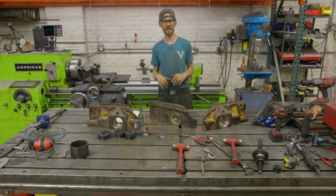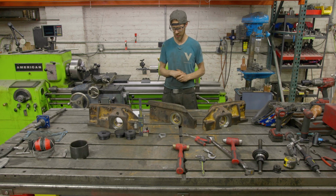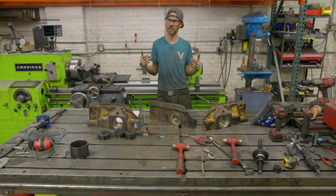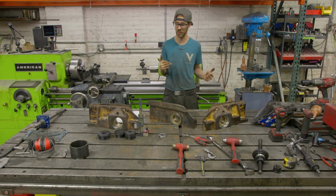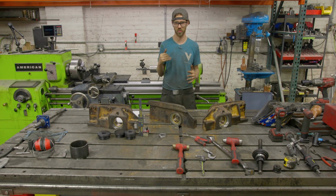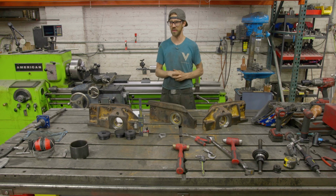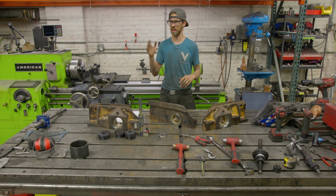The second thing is the radial drill, not really a good tool for this. Now the radial drill is a good tool for boring under certain circumstances, and it can do it. We did this job. But really the main thing that I struggled with was rigidity and feed rate. So my radial drill is set up with a minimum feed rate of 6 thousandths per rev, and it goes all the way up to 20.